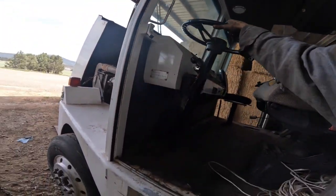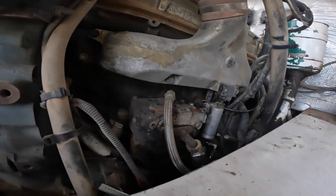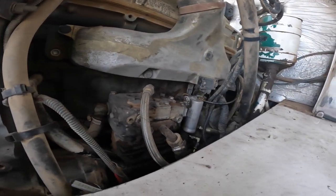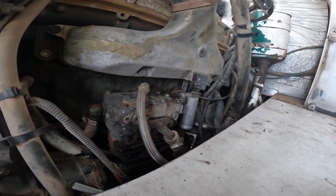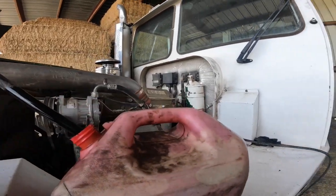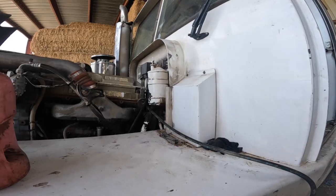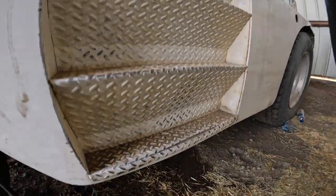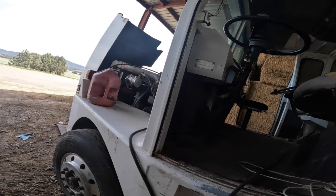And I got a 5-gallon bucket with a hose that we're going to put right here on the suction side of the gear pump and suck right out of the bucket and go right to the head. So let me get set up here. All right, so we're sucking right out of the bucket here. We got a gauge on it. I got it cracked up by the head. I just want to make sure that I'm getting fuel. I want to crank on it a little bit.